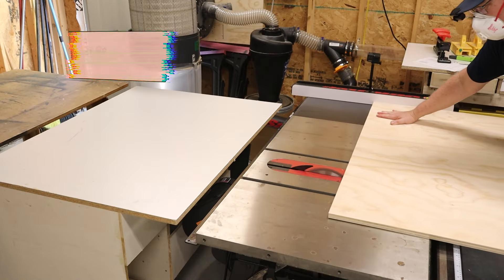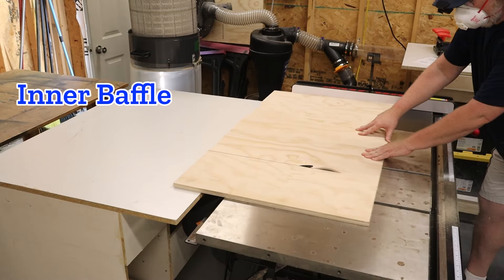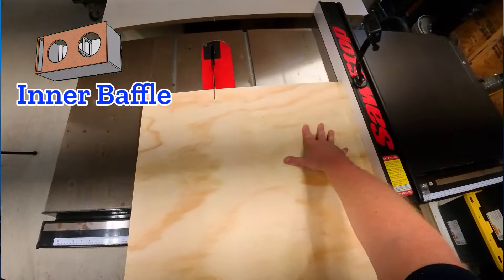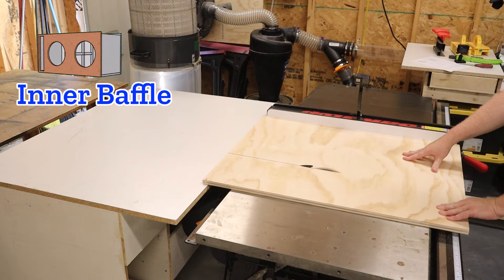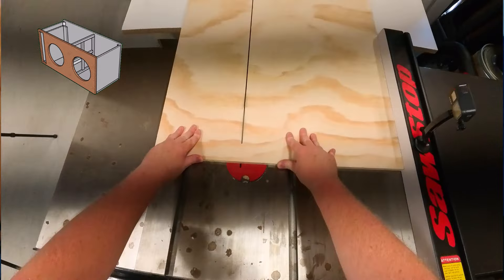You can see here I'm cutting a piece of plywood. This build is going to use a mix of plywood and MDF — that's going to be important later. Moving on to the back and the baffles, those are all the same height, so set the saw to that dimension and cut out those three pieces at the same time. I'll give you a link below to a video where I explain this process in depth.